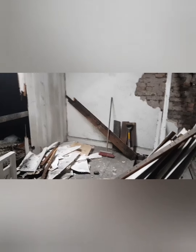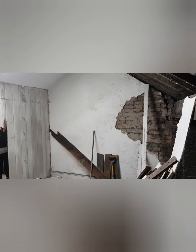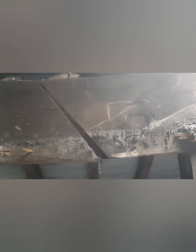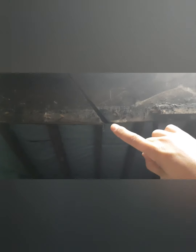I'm currently back at two flats through six-bed all en-suite HMO - this is the loft for a change, normally I start from the ground. We've got a few problems in here - all warts and all. Look at this lovely little crack here, but that's how they used to fit the beams in lofts. What's happened is all the excess weight on the roof is forcing that down, causing that crack to open.